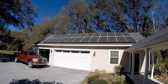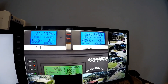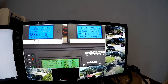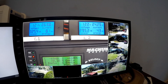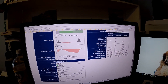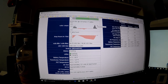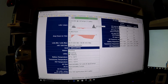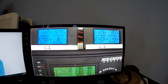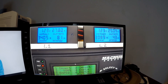Let's check the panel — it's in good sun, around noon, and fairly clean. We're pulling about six thousand watts and breaking even pretty much on the input and output. 100% charge on the battery, 53 volts on the battery bank, about 130 amps — but it's all coming off the panel. The solar is cranking out around six thousand five hundred to seven thousand watts, but it's being used, so the net is about zero. There it goes — the heating element kicked back on, back to sixty-five hundred watts, roughly 50 amps at 120 volts.